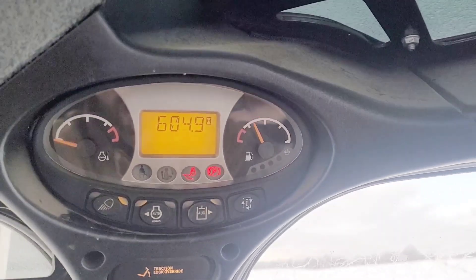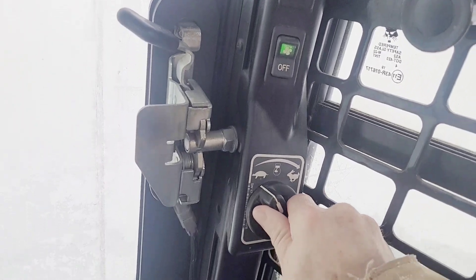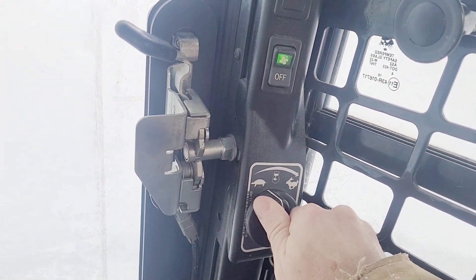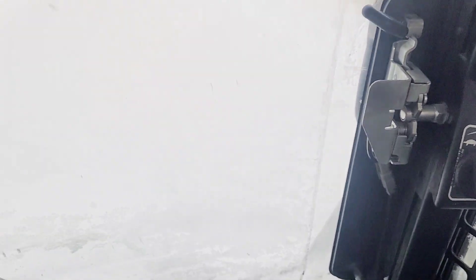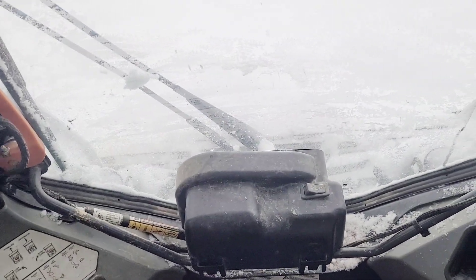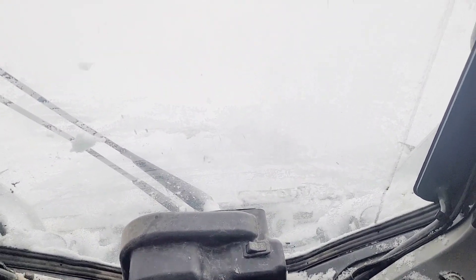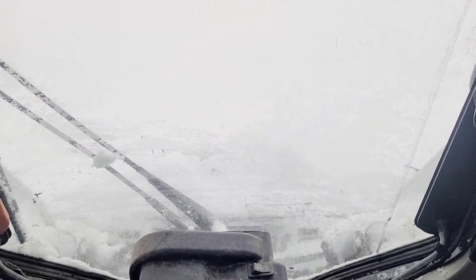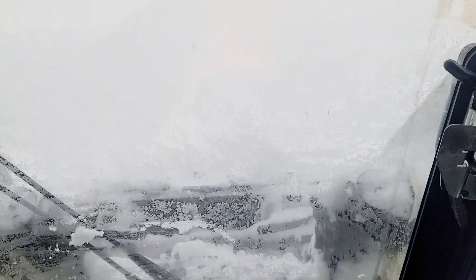The warning light is off. I'm going to take off my parking brake. First step is to get your throttle around one-third — just nice and easy. For the one-third method, you're basically exercising everything at one-third motion. So one-third throttle to start. You're going to lift the bucket nice and easy, go up about a third of the way, and down. Then go up two-thirds of the way, nice and easy, not forcing it.